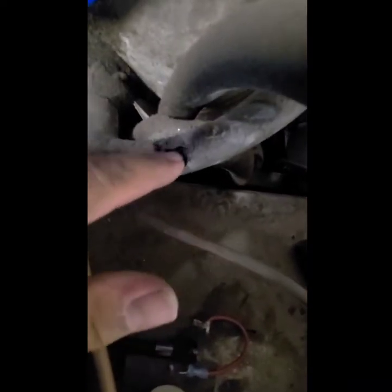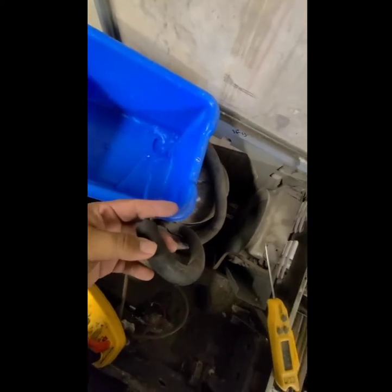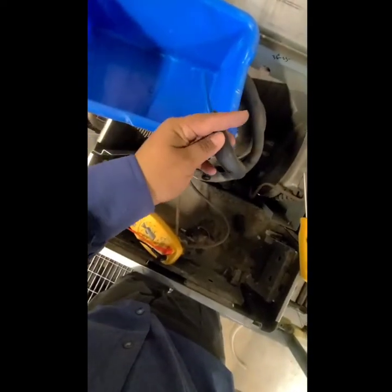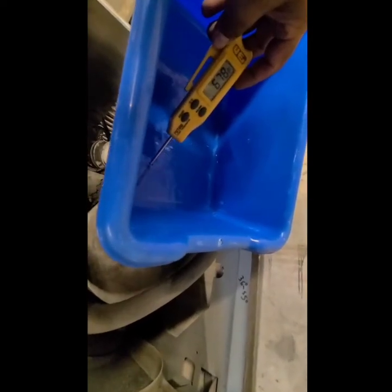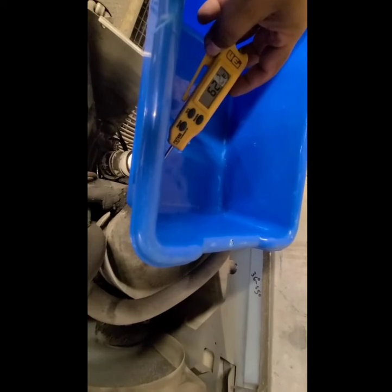We're ready to test the water. The unit has cycled — I pulled off a piece of insulation and the suction line is sweating, which means it's nice and cold. The ambient temperature in the building is still 82 degrees. I opened the water valve; the condenser cycled for about a minute and a half, which it did a couple times. It's a really small reservoir. Check out that temperature drop — from 80 degrees down to 63 within seconds, still dropping. It should reach around 57 degrees. These people are going to be very happy.